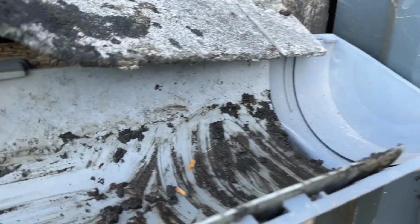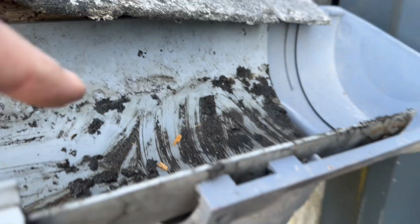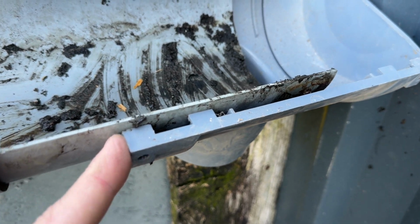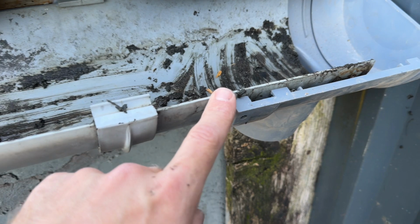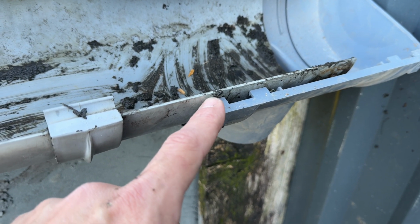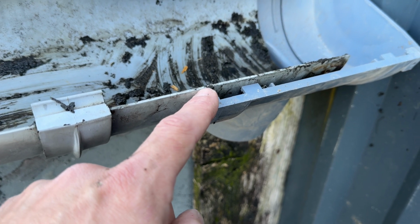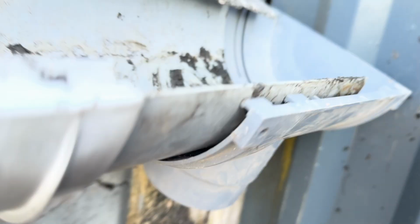All right, so I just offered that up. I've got the clips in underneath there. There's a bit more space there. That doesn't actually look that far out. Now, this is going to be a bit of a bodge and I'm never going to be able to get exactly the right one for this, so I think I can make it fit. Worst case scenario is to have a hot knife or a very, very sharp small saw, and you can just cut a little bit of the profile out to go underneath there. As long as that gasket seals down around there, that'll be fine.